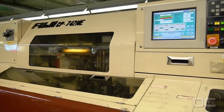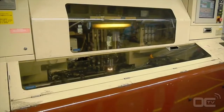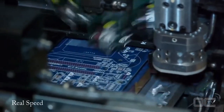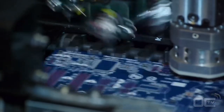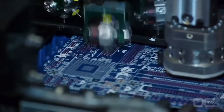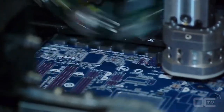All motherboards today have really thin and small components that are directly placed on the board — called SMDs. The high-speed chip placer can place from 5 to 10 components per second. Most of the components mounted by these machines are around a millimeter wide and must be very precisely placed on the PCB. Today's motherboards have components on both sides; the first side that goes into the factory process is the back side. Once the back side is done, a machine switches the board to the other side and the process starts again on the SMT line.